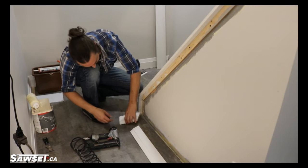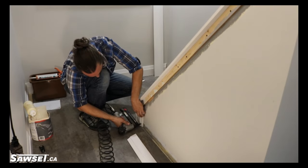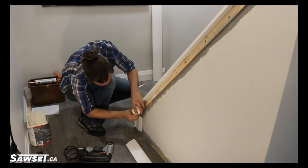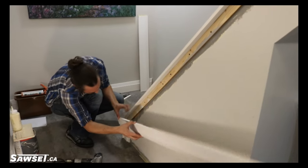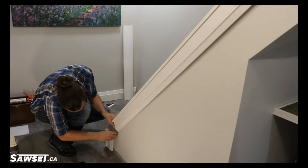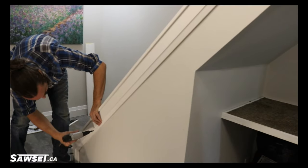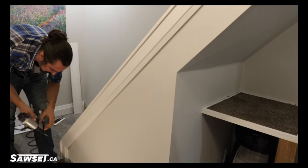Now that all your cuts are made, it's time to get to the fun part — start nailing away. A couple things I'll go over. For one, I like to glue my mitres. I know a lot of guys out there don't. It doesn't take much extra work. And just having the confidence knowing that this miter will last, probably as long as I will, it's just good to know. So it's a good habit. It's a good way to run your trim work if you can. I know a lot of guys might also glue on the backs of their trim just to make sure it's glued tight onto the wall. Also a great practice to work with.